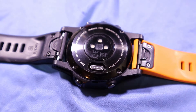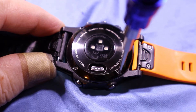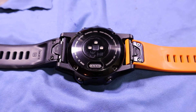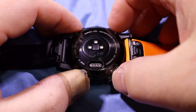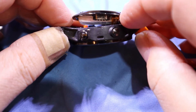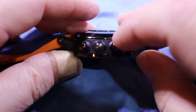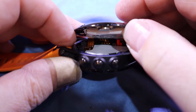For disassembly, they look like miniature Torx bits - a T5 seems to do the job, though to the naked eye it could even be a hex. The back just pops off with a fingernail under the edge. Inside we can see down the right side there is a flex cable we need to be careful of, and it possibly flexes open from the other way, so we spin it around for better access. The flex is now visible on the left side.